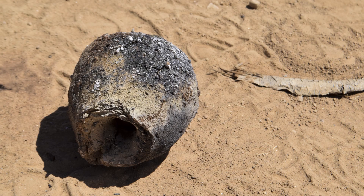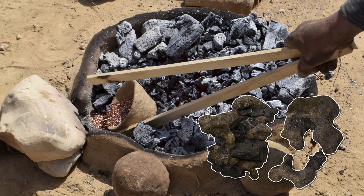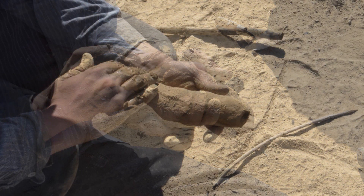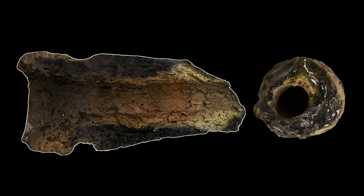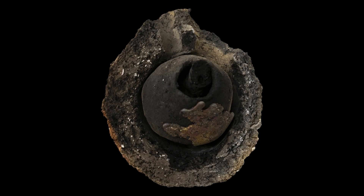But were we successful, or did we fail? Although we did not succeed in casting, the experiments were successful. We accomplished temperatures high enough to melt copper, and produced heated mold remains which will be further investigated in the laboratory. By a lucky accident, we also proved that the furnaces could be successfully operated with a single bellows. The spilled copper melted completely, and we gained valuable information about the suitability of the local loess for metallurgy. No heat fractures occurred, even with only sun-dried materials. With more training on the furnace, we would surely manage to better concentrate the heat inside the crucible. Last but not least, with antimony instead of copper we even succeeded in casting.